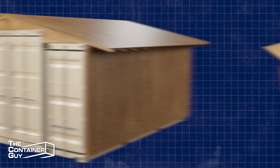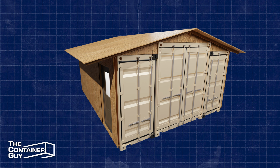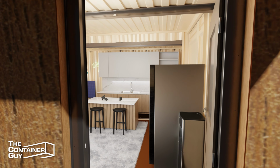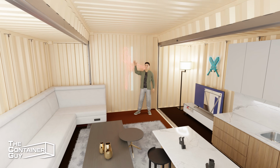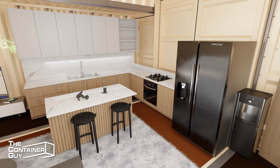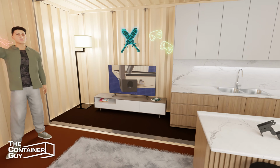This method of making double wides allows you to have vertical posts if you need them, only 4 feet from the wall and not right dead center in the middle of your room. Follow along as you watch us struggle to cut containers in half, learn a whole bunch of lessons that we're going to take into account, and come up with an easier, better way of doing things. Hope you'll learn something.